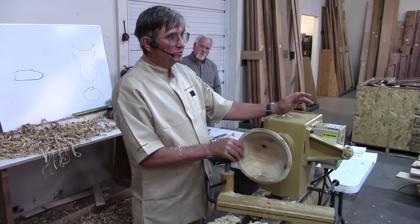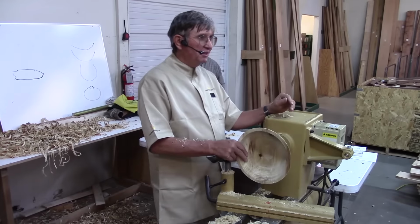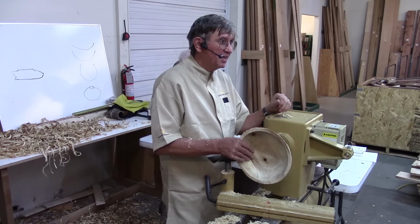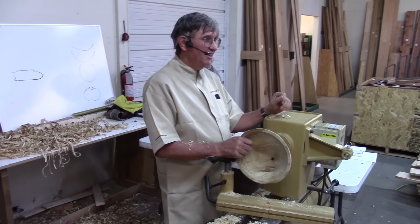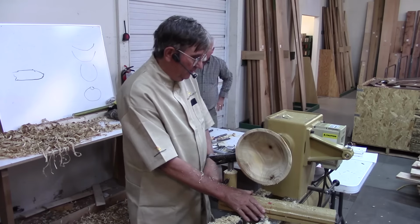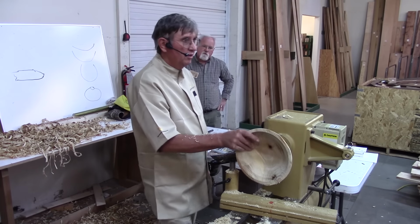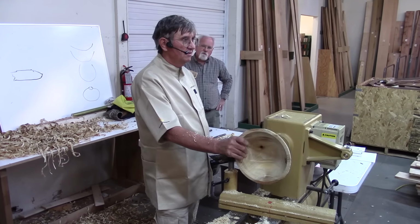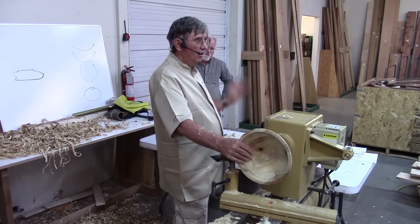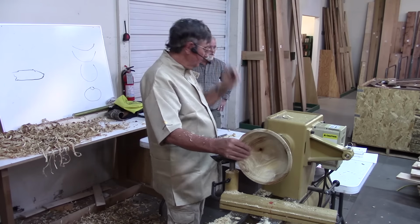But you can't do it too many times. I had a piece of cottonwood out of this very same tree, and I'm going, let's see if we can get this all dry today. And on about the fifth time, I went, that's not steam, that's smoke. I had to shut it down and run it outside before it caught everything on fire. So you got to be a little careful with the microwave. There's other ways to do it. Putting them in a paper bag seems to work. Putting them in a plastic bag seems to work if it's just a little bit open, so the water kind of gets out slow. But the key is a constant temperature and the water not coming out too fast. That is the essence behind it.